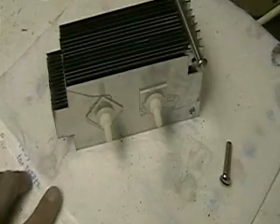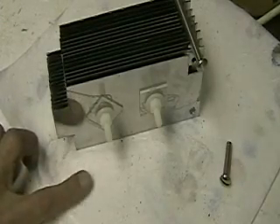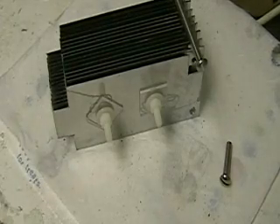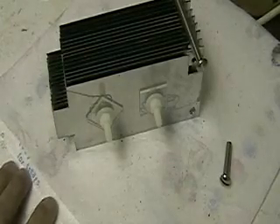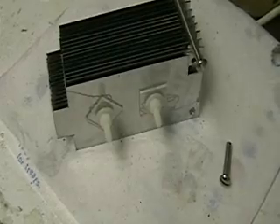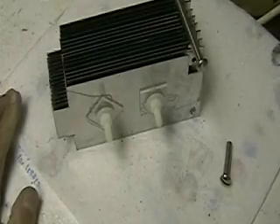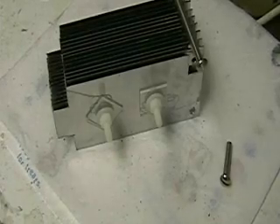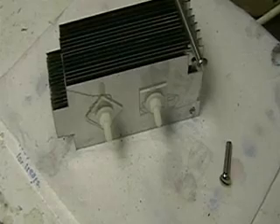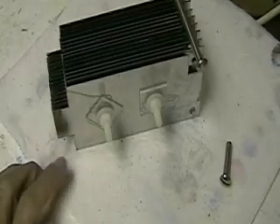The reason there are 16 plates in here instead of 15 is because since there are two extra notches on these plates, you are losing some area. The question is whether losing that much area on each plate really matters that much, and I take it to you that it really doesn't — the Aran cell puts out so much hydrogen as it is. If that is a problem, then the answer is not to get it with that addition. The N16 is only for those who want to experiment. My personal opinion, for what it's worth, is it's worth the loss on the plates — the extra plate more than enough makes up for the difference.